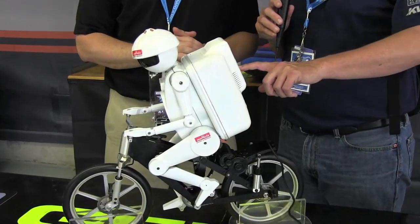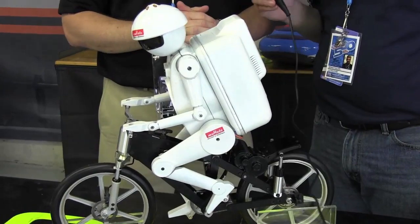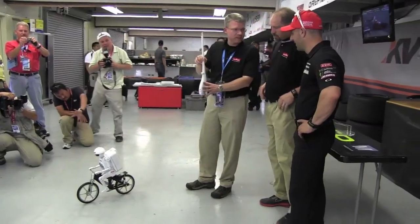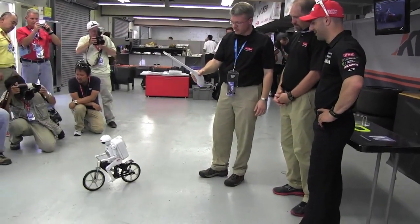This is powered by a lithium-ion battery that you guys built. It's kind of a proprietary type — a new technology for us in that aspect, but it is lithium-ion. There are two three-cell sections in there and one two-cell section, giving twelve and a half volts and eight and a half volts.